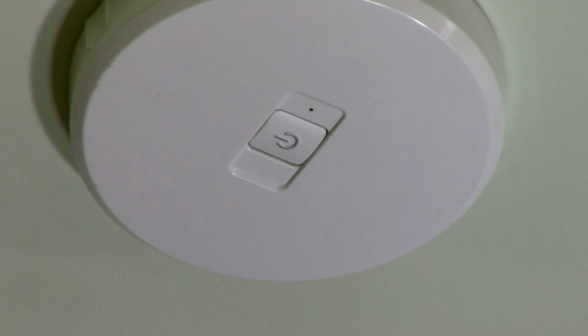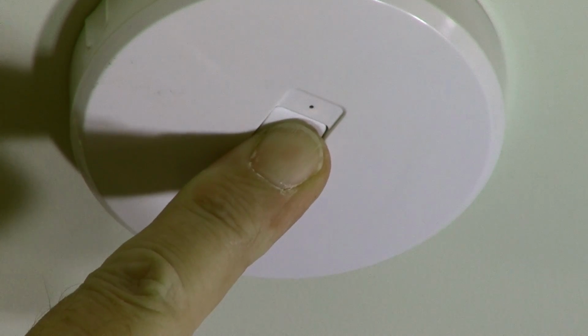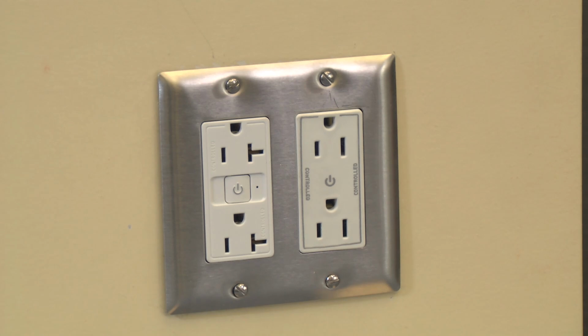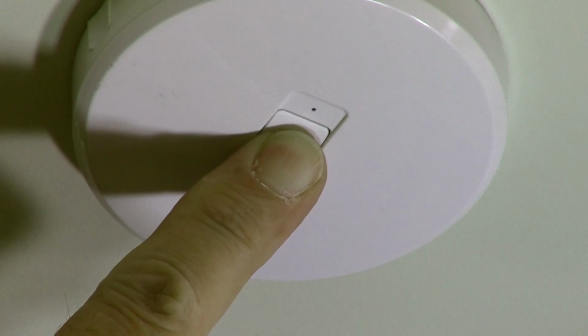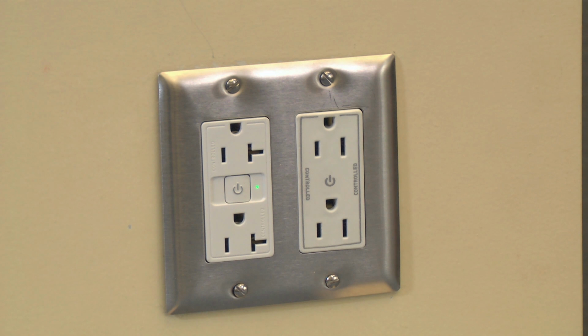And finally, you're going to return to the RF signal pack and press and hold the bind button for 5 seconds until the flashing LED on the RF signal pack turns off. All RF receptacles in the same room network will stop flashing, indicating that binding is complete. And last, we are going to test that binding has been successful by tapping the push button on the RF signal pack and confirm that the green LEDs on the receptacles turn on and off.